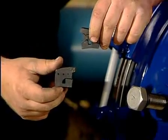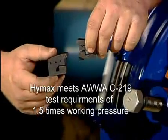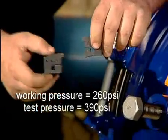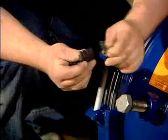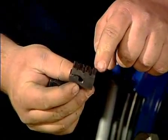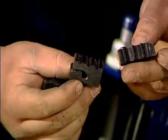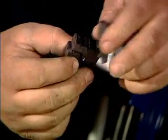The gasket rating is 260 pounds working pressure. Per AWWA, the test pressure requirement of the gasket needs to be 1.5 times working pressure, so all of our gaskets are tested to 390 pounds. When we tear the inner layer of the gasket out, you'll note a series of teeth on the inner layer. The teeth are there to maintain integrity between the top layer and bottom layer of the gasket, so that if there's any longitudinal movement on the pipe, the gasket layers don't roll and pull out and tear apart.